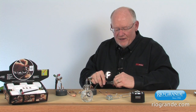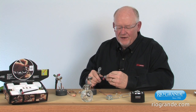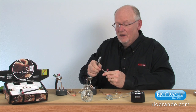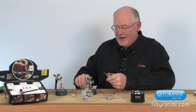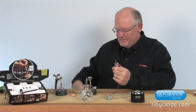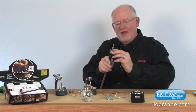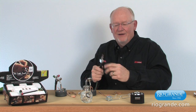And now we're going to show you the size and how we light the larger tip. Now obviously with the bigger tip, a number 7, we would increase the pressures on this tip a fair amount so that we would use it. But we've got this set up at a high pressure right now. I'm just using a crescent wrench to tighten this up a little bit. Oftentimes you can just tighten these by hand. If you have a leak, it'll buzz or flame up a little bit around the tip nut, so you'll just shut it off and then relight it.